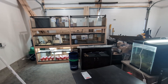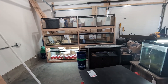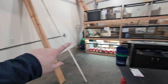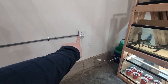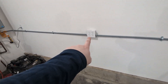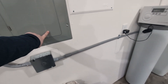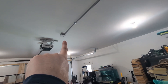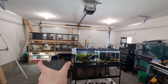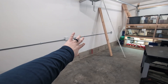This is becoming a much longer project than I thought — this stand took me an entire day to build. We also did all the electrical work: a conduit with four outlets on one circuit, another four outlets on a second 20-amp circuit, and another four outlets going up to the ceiling on its own 20-amp circuit. The ceiling one will power the rack in the middle for large tanks, and the wall outlets will fill the 20 gallon wall.